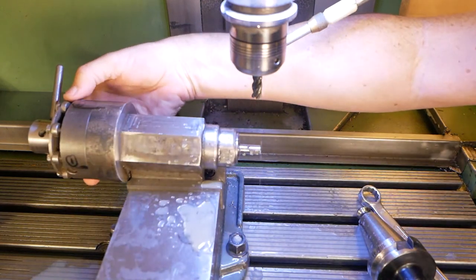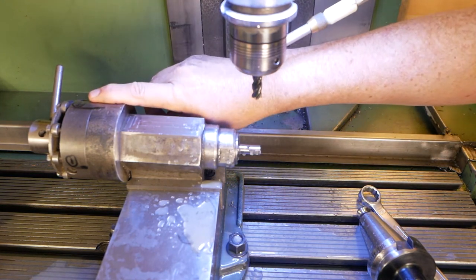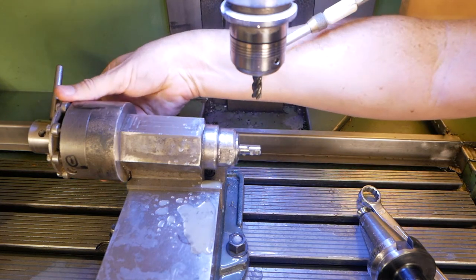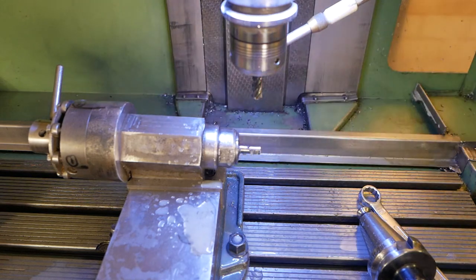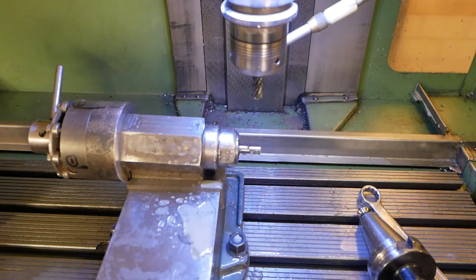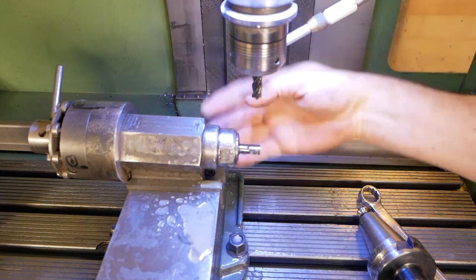It's kind of a cool design, this. It's got these spring-loaded plungers in the body which drive out and lock, and then this ring is just a bunch of pins to push on the end of those plungers, and there's a number of them, so it's really quite rigid. It had basically zero play. I'm guessing it was probably an apprentice's job at some stage. Unfortunately, someone's hammered on it and it looks like it's been used as an anvil. But I'm actually quite tempted to remake this for the collets of the Schaublin, because it's such a cool design.